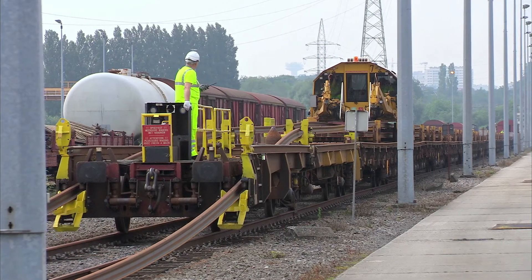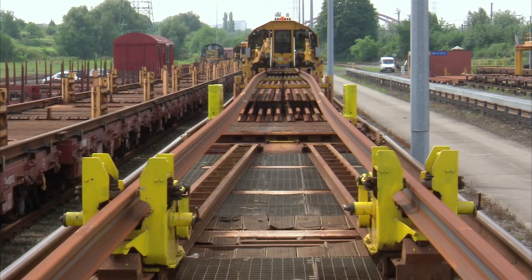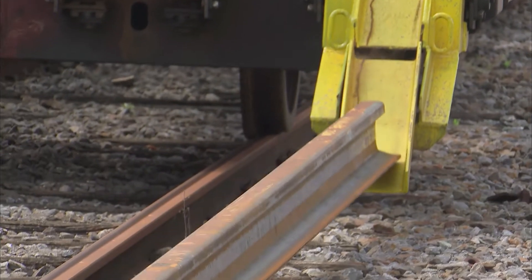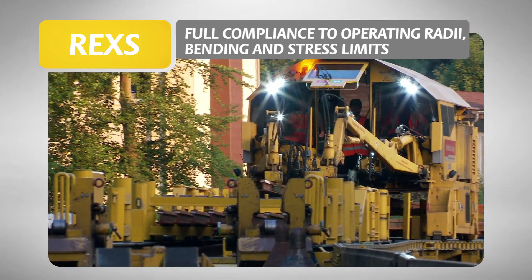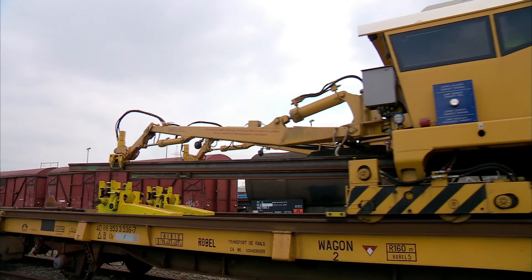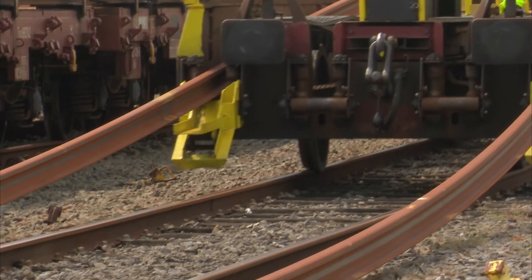The rails are unloaded within the stress limits, with tilt protection in narrow radii and super elevations, without cost-intensive reworking of damaged rails. Rail manipulation in narrow curves and super elevations presents a challenge. The universal roller heads prevent the rail from tilting. The bending and stress limits are adhered to.